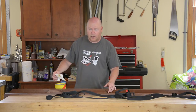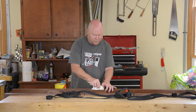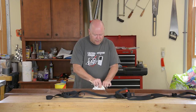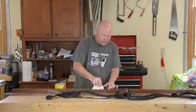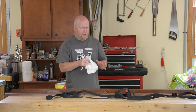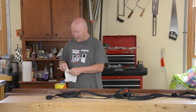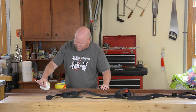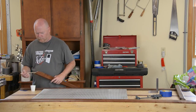I'm trying to get a good bit of wax down in these slots — partially to lubricate the aluminum and make it slide better, but honestly mostly because there is just no other finish down in here. If we ever decide to put a mister or something on this cage, that's the last place I want to swell up and change dimensions, so the wax will offer at least a little bit of protection.